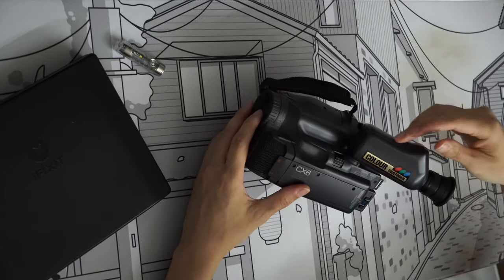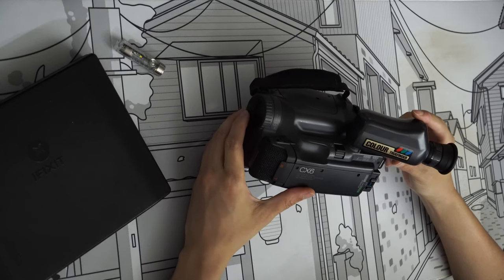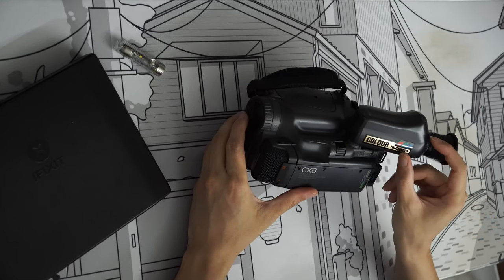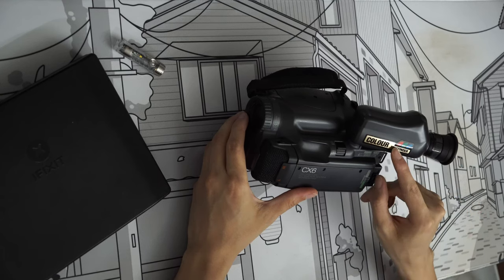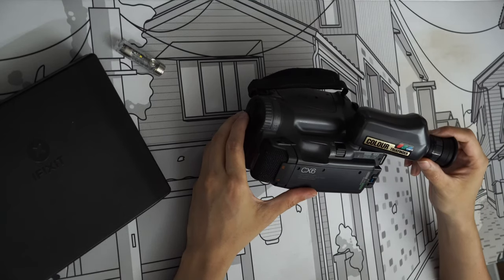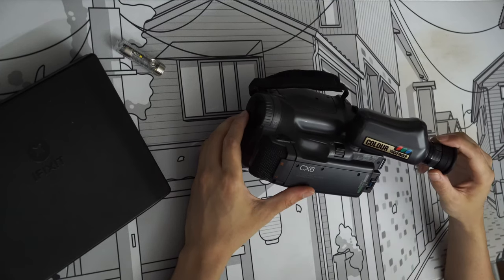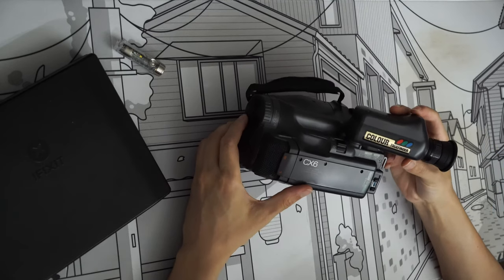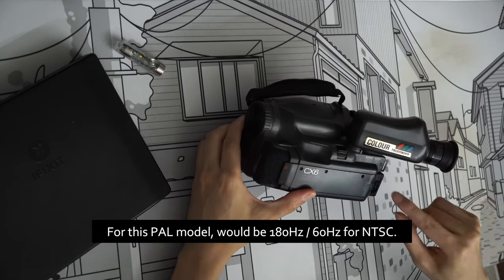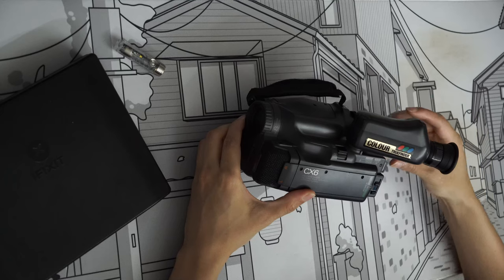It's got quite a funny shape here, and the reason for that is because this is using a color wheel, which is a rotating cone. In fact, not a disc, it's a rotating cone that switches between red, green and blue in front of a black and white tube. So this actually uses a black and white CRT with a filter that turns really fast in front of it. From the documentation I read online, it should be working at 150 hertz, so each color is displayed at a third, so 50 hertz, so that would be pretty impressive.